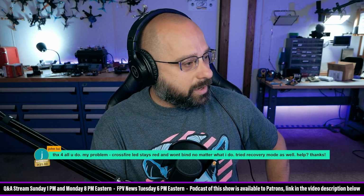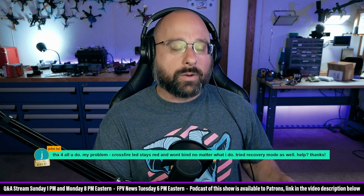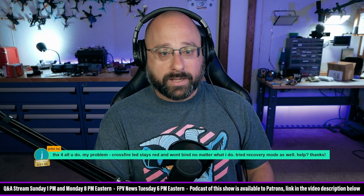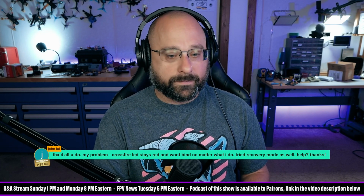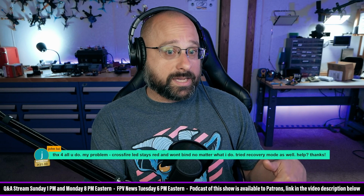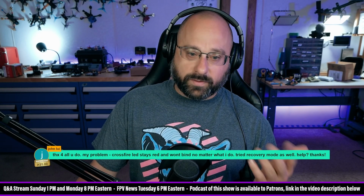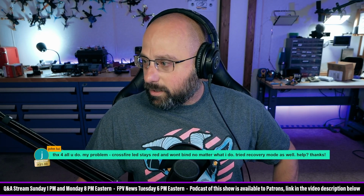Yeah, I think what we need to know is when you say it stays red and won't bind, does it go into binding mode? If you power it up, within 60 seconds, you press the bind button once. You don't hold the bind button or any of that nonsense. If at that point it doesn't start blinking, indicating it's binding, something ain't right. And if you can't get it into recovery mode at all, like if you hold down the bind button and power it up and you still get solid red LED instead of the blinking green LED, I think you just have a fried receiver. It's just fried, if in fact that's what's happening.